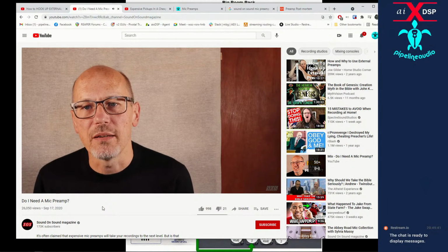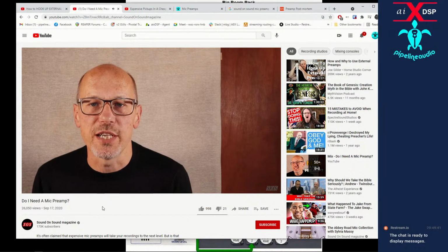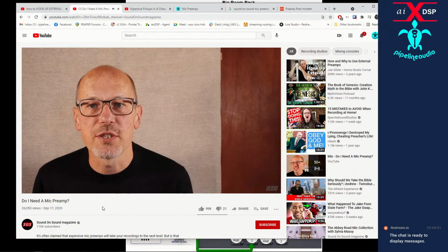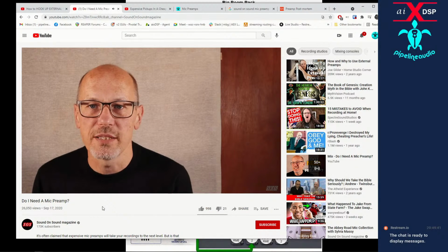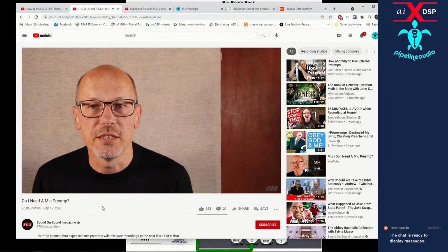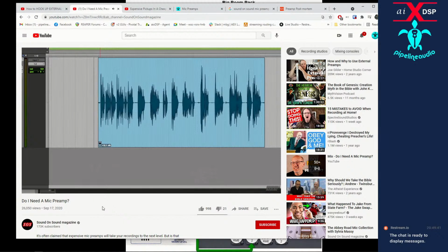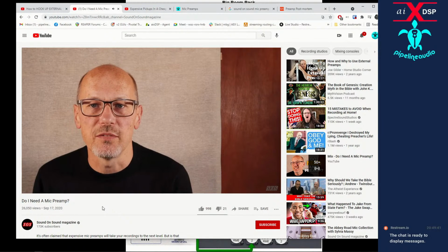Well, yes, you can. But before you do, it might be worth asking whether you really need to. This is because the signal to noise ratio in something like speech is probably only around 40 decibels, and the dynamic range on the inputs on your audio interface is going to be at least 100 dB. So from that point of view, it actually doesn't really matter whether your signal peaks at minus 10 dBFS, minus 20, or even minus 40. All you need to do is record it and then turn it up afterwards in your DAW, and it will be exactly the same signal with exactly the same noise floor. So from a purely technical point of view, low signal levels aren't necessarily a problem in 24-bit recording.